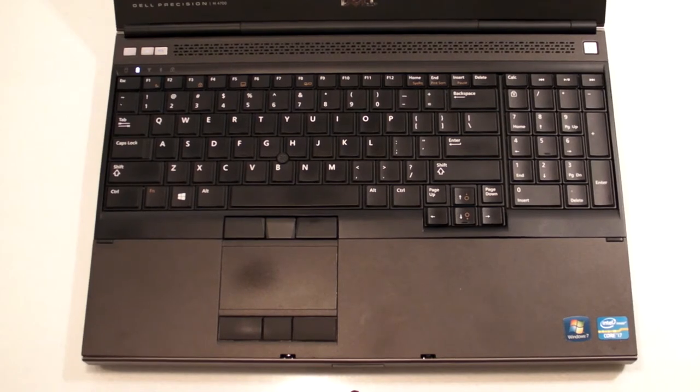So once I pushed the video card and seated it correctly, it had just crept out because of a phenomenon known as thermal creep, which is when you turn things on and off and they heat up and cool off. Sometimes they move mechanically. This can happen with edge cards. So what ended up happening with that computer was the video card had become unseated and was no longer being recognized in the system. And that prevented the machine from booting whatsoever.